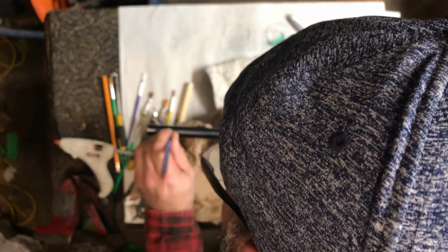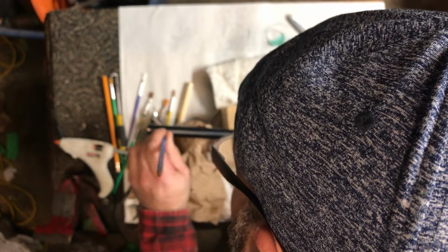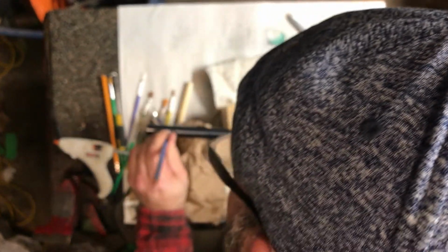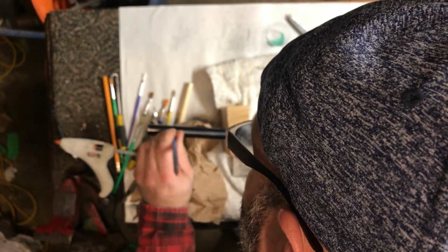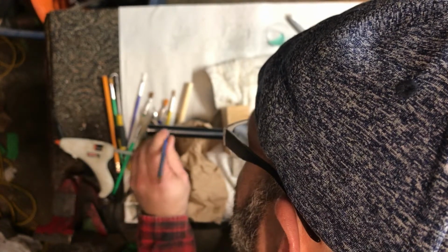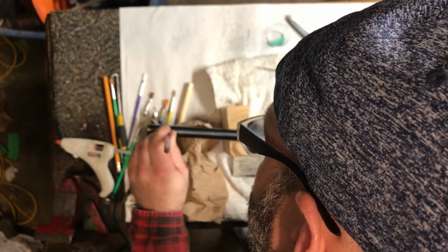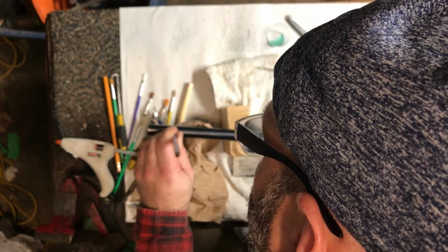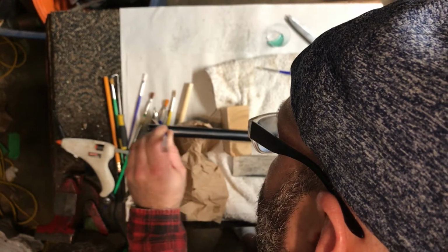And same kind of principle. And if you feel that your eraser method is not enough grit, and you're like, oh, well, 1500 is enough, this is what I would tell you. Rub longer. Have some patience. And then if you're still unhappy, cut a new piece and don't kill the grit on the whetstone as much as before.